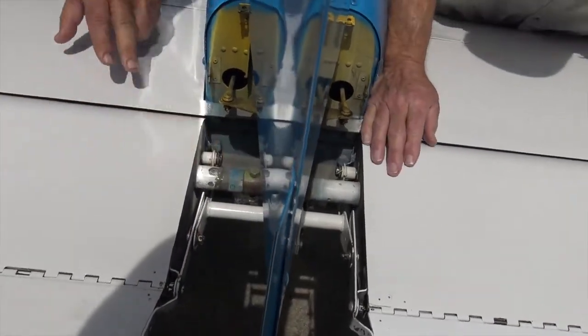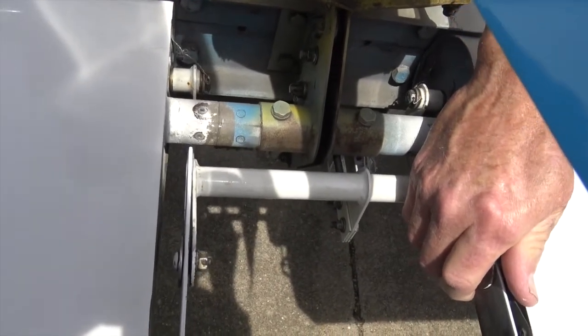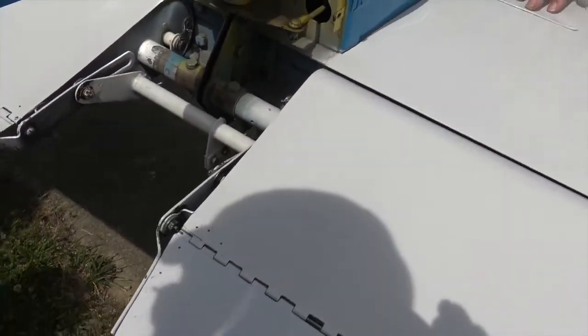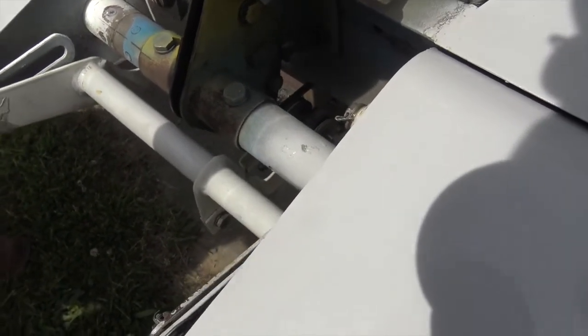Are we getting any movement right here against the bolt? It's all right here on this. This one and this one are disassociated. And all of that — that's a Cherry Max instead of a solid rivet. You can't put a solid rivet in there. It's getting a little bit of movement in here. It's moving up in there. Looks like it's coming up and down rather than rotating through the axis. See, this thing pivots here at this point, so it's going to move up and down. But if the hole's elongated, this would shift inside of this, and it's not doing that.